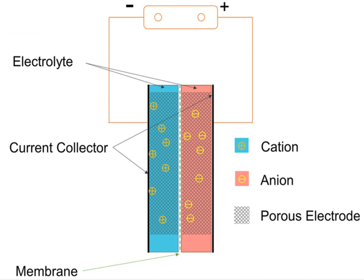Electrodes for pseudocapacitors. MnO2 and RuO2 are typical materials used as electrodes for pseudocapacitors, since they have the electrochemical signature of a capacitive electrode, linear dependence on current versus voltage curve, as well as exhibiting Faradaic behavior. Additionally, the charge storage originates from electron transfer mechanisms rather than accumulation of ions in the electrochemical double layer. Pseudocapacitors were created through Faradaic redox reactions that occur within the active electrode materials.